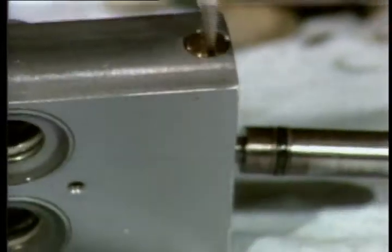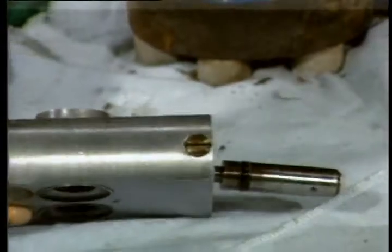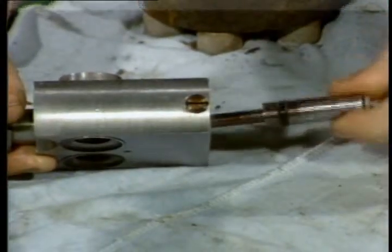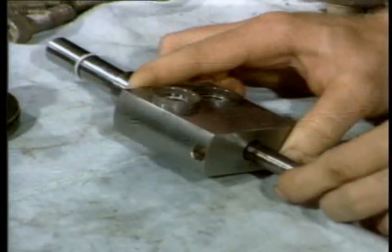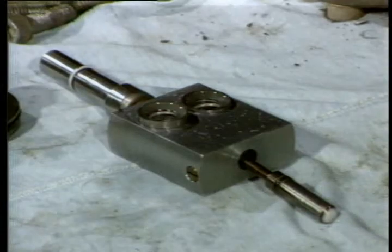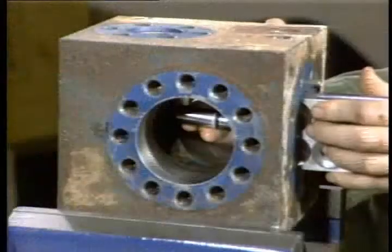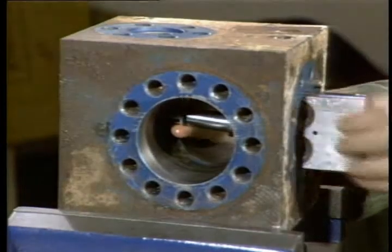After you replace the poppet and screw, give the poppet a tug, just to make sure the screw will hold it in. Make sure the screw is snug. You can even put a drop of Loctite on it to be sure. If you have to use a brass rod to seat the plunger guide, tap it gently. Then slide the seal container in from the bottom.